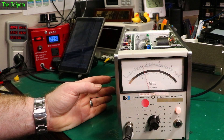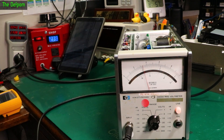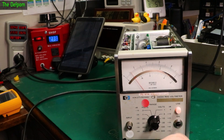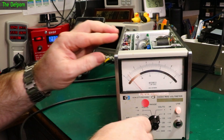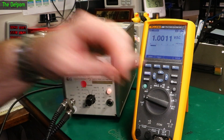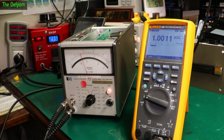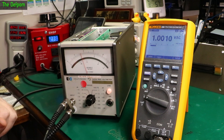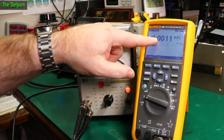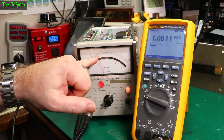So does this need calibrating? Possibly. There's more verification needed using different generators and measurements to see what we're getting. What we could do is tee this off and hook it up to a multimeter at the same time - we'll look at a digital multimeter versus this thing. So I've hooked up the Fluke 289 at the AC volt range - it's tapping off just here, straight onto the front of this meter. It's actually a daisy chain which isn't ideal - I should be tapping off directly from the front of the generator. But this is close enough. You can see we've got more than 1 volt on here, bouncing slightly, and basically almost exactly 1 volt on the Fluke. This HP is actually reading very slightly high - about 1.08 or something.